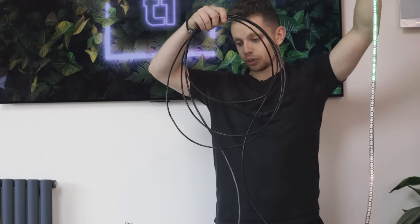So we have our first LED strip installed running the effects. Jed has helped me do three more of these. With these connectors we can basically just connect them together. The beauty of this is, let's say you wanted some space between each one of your strips — just like we did between the first LED strip and the ESP board, you can just snip these cables and extend them to be pretty much as long as you'd like. With a little bit of fiddling we've got all our LED strips set together. If I go into config and click on LED preferences, we've got 576 piped into our length, which is how many individual LEDs we have in our massive strips here. If I go back and turn them on — oh wow, look at the effects! All of these LEDs right here are being powered off the USB, and that's why they're quite dim.